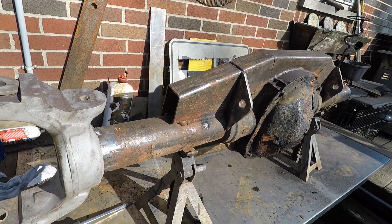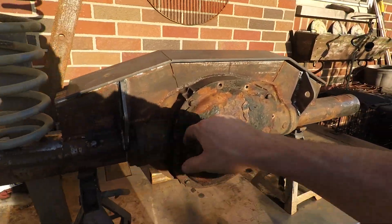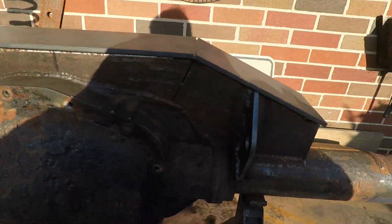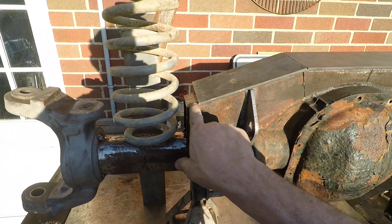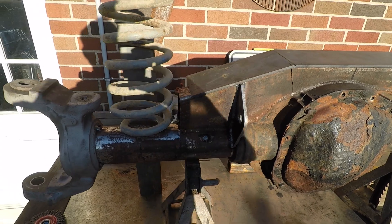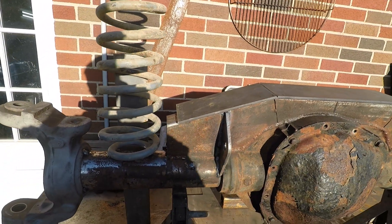Got a few ideas on how I'm going to do that. I've got my pieces welded in, got the top of my truss tacked on. Cut the same distance from here to here and here to here — obviously I came up a bit short, so I'll have to extend that piece and cap the ends. There'll be a couple of pieces scabbed on the back here to fill in, because this is just 1/8 inch — I'll put another piece of 1/8 inch in there to double that up.